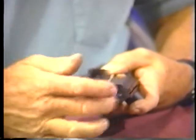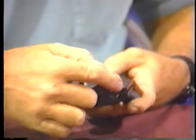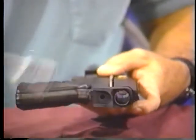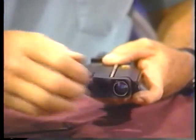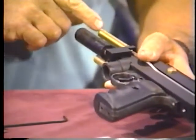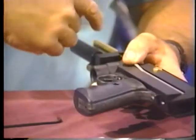And you rotate it. Keep turning it in till it stops. Okay, right there. And what you want to do is continue on until the bolt hole lines up, so you can put your bolt in it at that point. But we don't want to put it in just yet. What that does is keep the ram from beating the back of the body out. In other words, it preloads the block instead of preloading the ram when it comes forward.